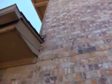This is the garage ceiling, and you can see here this is evidence of water penetration running all the way along here, and it's current. The water is actually penetrating, which I've pointed out already, but just for completeness I'll go around here. Water is penetrating here into the attic, and it's running along the soffits and along the drywall up here. It would also be running into the wall system here. And you can see, if you look at the wall system, there is evidence of prior water penetration.